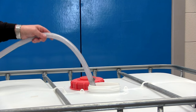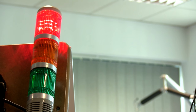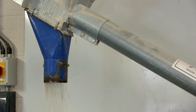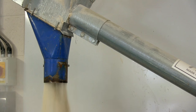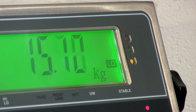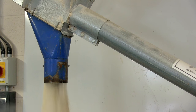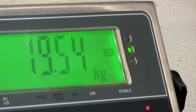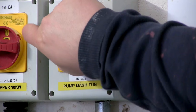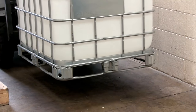If you need a much more visual indication, a high-low light tower is available which simply plugs into your JIK indicator. By adding the relay board to your order, your JIK indicator can effectively control other devices, and this works really well with the high-low alarm. In this case, the relay board has allowed the scale to be connected to a hopper feeding produce onto the scale. Because we've set up the high-low alarm, when the scale reaches the target weight it actually switches off the feed — meaning less user input, faster weighing processes and potentially less waste.